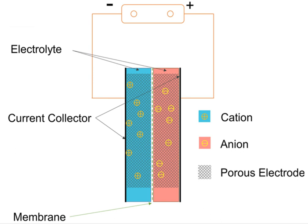With the same activated carbon electrode, an aqueous electrolyte achieves capacitance values of 160 F per gram, while an organic electrolyte achieves only 100 F per gram. The electrolyte must be chemically inert and not chemically attack the other materials in the capacitor to ensure long-time stable behavior of the capacitor's electrical parameters. The electrolyte's viscosity must be low enough to wet the porous, sponge-like structure of the electrodes. An ideal electrolyte does not exist, forcing a compromise between performance and other requirements.